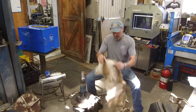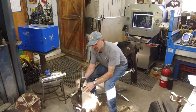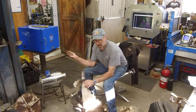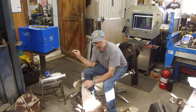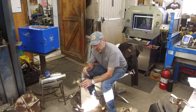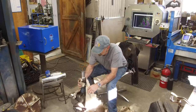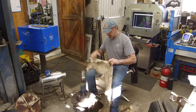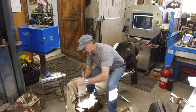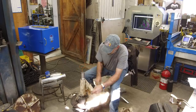All right, I got some scraps of aluminum cloth. I'm going to put this around here. More than anything else, it just helps hold a uniform temperature on here. But also, if you accidentally have a droplet, arc, or spark or splatter, I really would like to have it stay on the area that I'm building and not get onto any of the other part of this shaft here. So I am going to wrap this right up close to the top here. In fact, I'm going to start out by giving a nice wrap right above those threads. Nothing worse than having threads munged up.